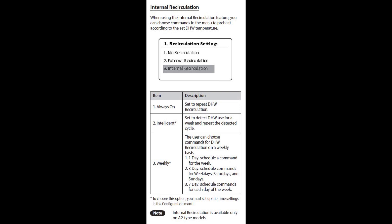And then every 30 minutes after that it checks — at 5:30, has it dropped more than nine degrees? If so, kick in. Otherwise it just keeps going and it'll check at 6:00, 6:30, 7:00. So every 30 minutes it checks, and if it's nine degrees or more difference, it'll kick in. And then absolutely it will stop at the stop time, let's say 8 AM.